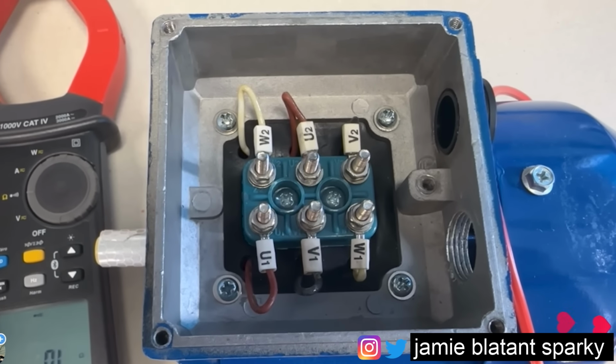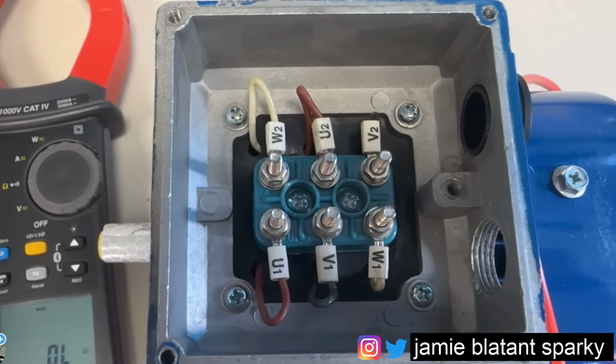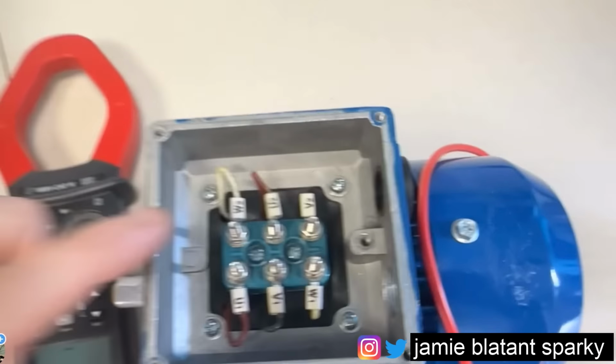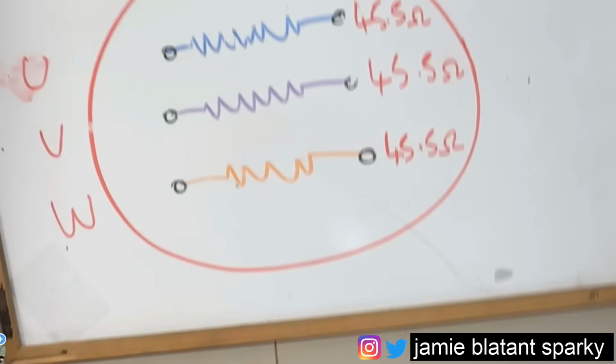There's a clean shot of them without the crocodile clips on, yeah. You might not have the numbers on them. They might be coloured or they might be wrong. So if you have to bell them out and check them and make sure your windings are staggered across, going there to there, and then that to the end. And then I've recorded it on here.